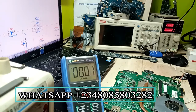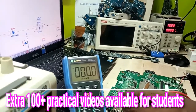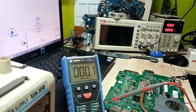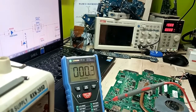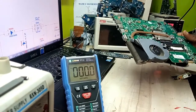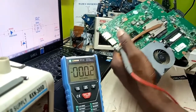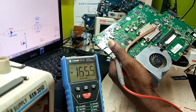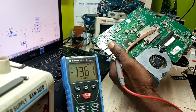3.3V is at about 90% and 5V is not present, but if you check with your meter you will confirm what's going on. I've bypassed this port because there is no charging port. As you can see, this is the charging port, this is the first fuse, this is the first diode, and this one is serving as the first MOSFET in this motherboard.